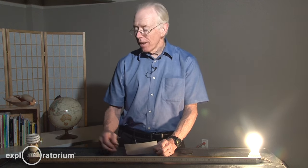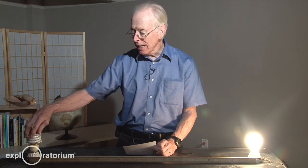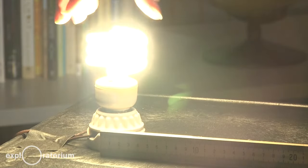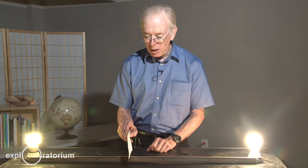You can use this technique to compare the brightness of two unknown light sources. The makers of this compact fluorescent lamp claim that it only uses 18 watts of power and yet gives as much light as the 60-watt incandescent on the other side. If that's the case, then when I turn it on and it warms up, I can use my card to find out if it's giving the same amount of light.